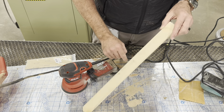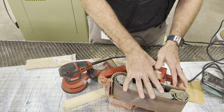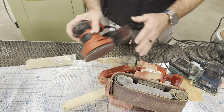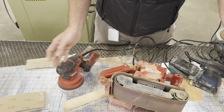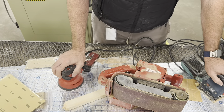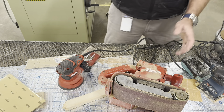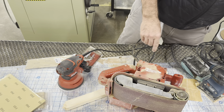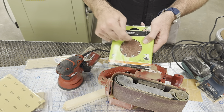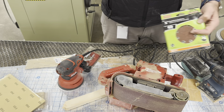So we have three different types of sanders: the big belt sander, the vibrating palm sanders, and the random orbital sander. Sandpaper is classified by grit - the numbers are on the back - and 80 grit is really rough. We'll show you how to put sandpaper on these when we get started. We'll be using these for our stool project. Today's video is sponsored by Gator Power, which makes hook and loop sandpaper classified by grit number - a pretty good brand we'll be using in class.